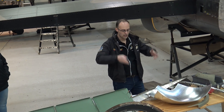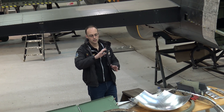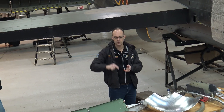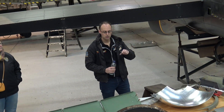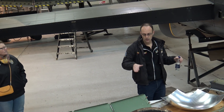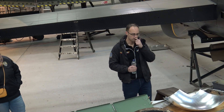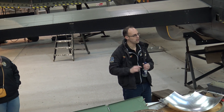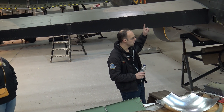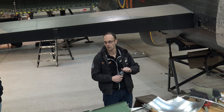In between those we have what we call stringers — aluminium bent to an L shape with a further kick off the top, to add extra strength. We've had to have a lot of those made, and they've got a strengthening piece riveted inside them. What they found with early Lancasters is the wingtips would fold up — where the wingtip meets the extrusion, it would actually fold up and back onto itself. They lost quite a few of the very early Lancasters like that. We suspect this strengthening strip in the stringer was added to counteract that folding. We actually have crash wreckage here of a Lancaster where the wingtips folded up and it crashed — it's documented that was the cause.